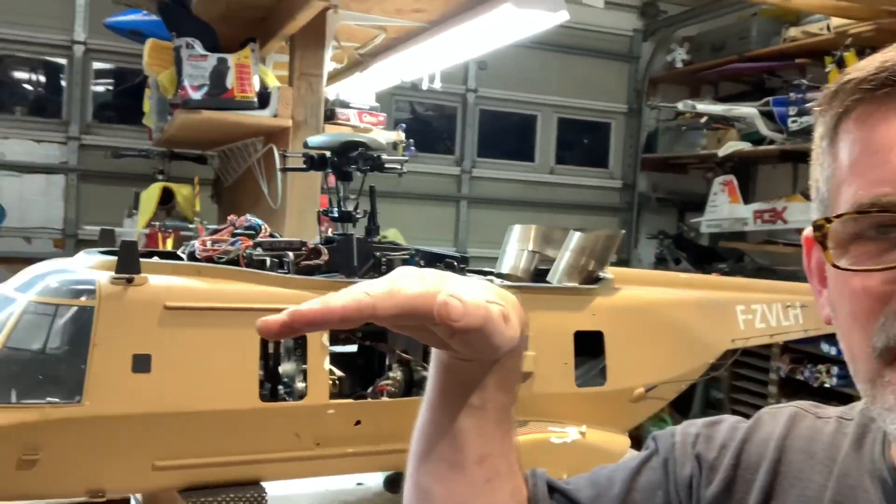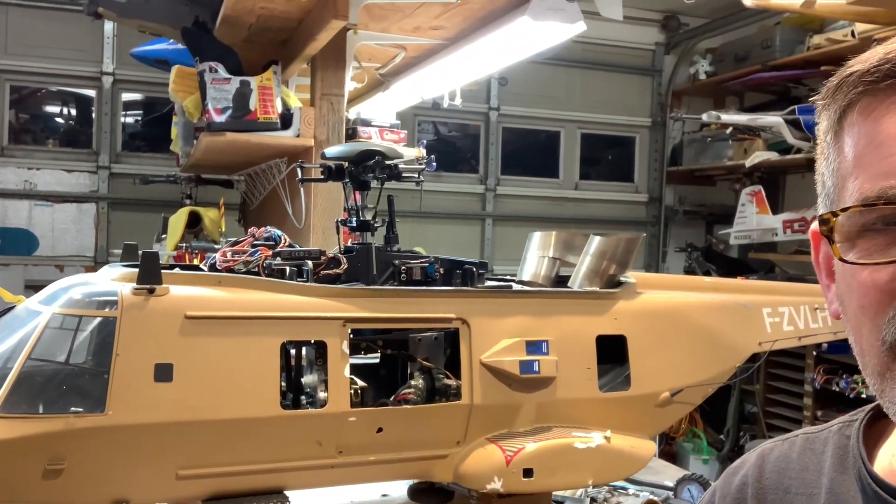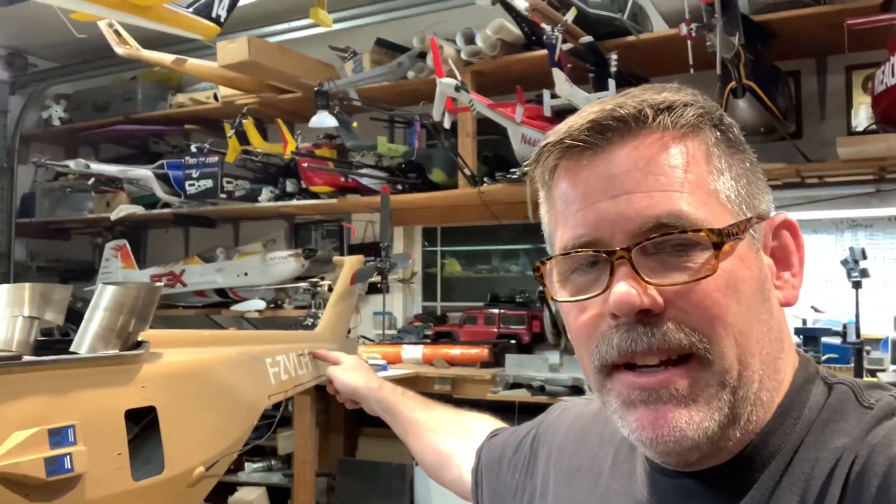Can't find any of the gears — not finding anything in the 40-degree size. These little stupid things are killing it. If you look, you can see there's a forward tilt on the mechanics. When they made the tail with the two-millimeter drive wire, they had you put like a 10mm drop bend across the whole thing. Going from the IGB, which blew up, it kind of gave it that arc, which made it line up with the forward tilt.